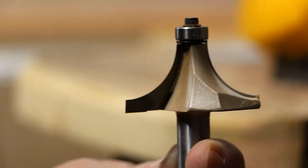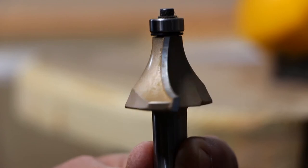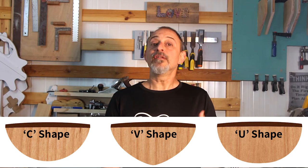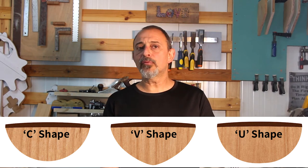The third bit is larger and used in a less conventional way, but in the age of CNCs, anything goes. This is a non-even radius of about 1 inch. You can get similar bits with specs matching your preference, but the principle is the same. I used this bit for rounding the back of the neck — one pass on each side will give you a perfect U shape. If you prefer a rounder C cross section or a vintage V, you can either file and sand a bit more to achieve just that, or you may be able to find just the right bit for the profile you desire. If you're going to manually finish it up, you can even do a non-symmetrical shaped neck. What I'm getting at is that you will eliminate about 95% of the rough grinding and filing with this simple bit.